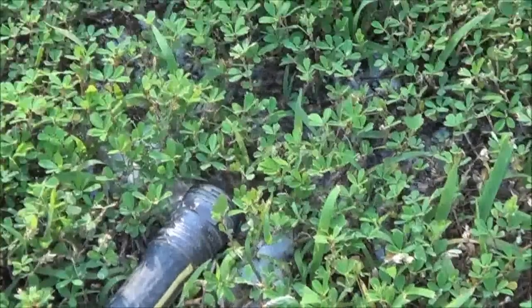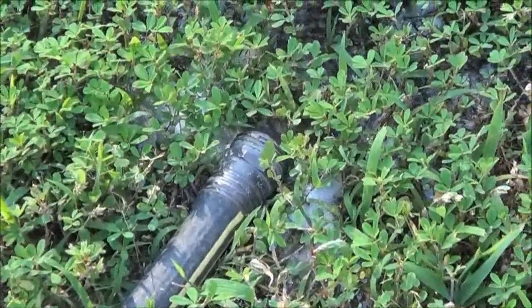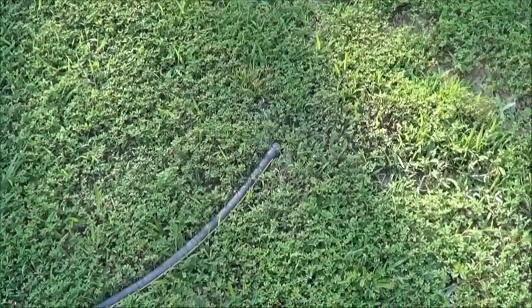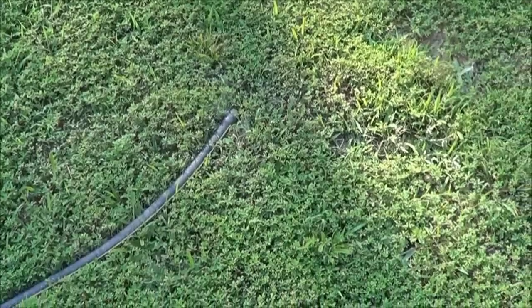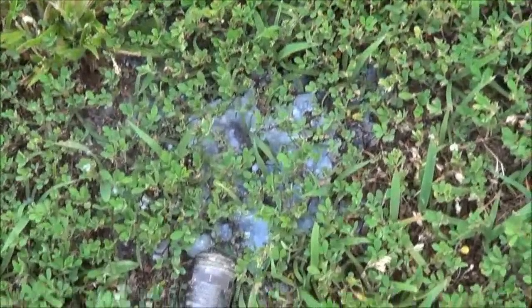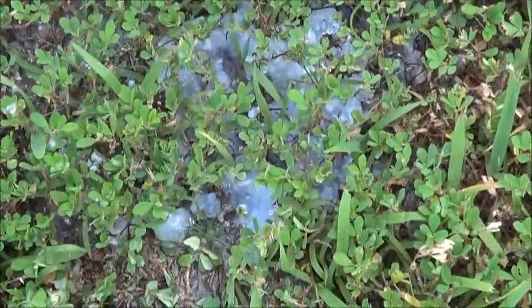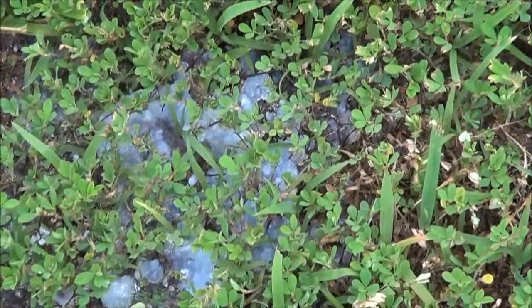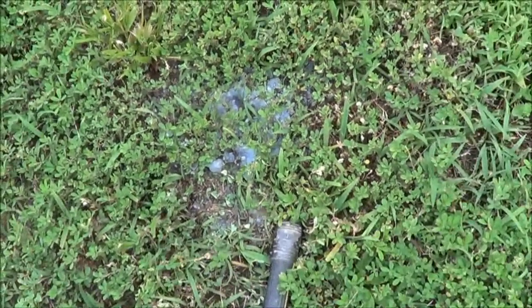As you can see, the water is flowing out of the tank now. Let it run for about 15 minutes and check on it every so often to make sure it's empty. You may notice some white spots or areas — this is from the minerals in the hot water heater. This is a good way to flush them out, and also a good way to drain the hot water tank if you need to change the heating element. Once it's finished draining, you'll notice all the white stuff coming out — that's the crud from the water. A lot of it clogs your pipes and your heating element, causing it to run longer and hotter. That's one of the causes of why hot water heaters go out.